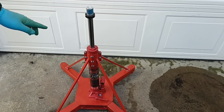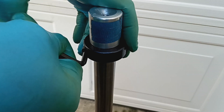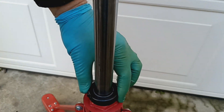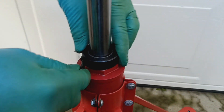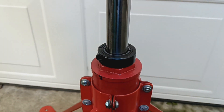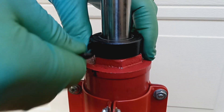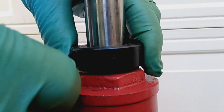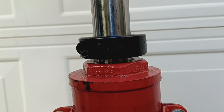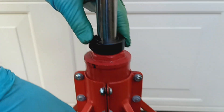There's a safety collar that I had installed — it's a commercial off-the-shelf collar with a 25 millimeter diameter. This collar was down against the top of the jack and tight on the shaft. The pump wasn't working and I could not raise it. Normally I wouldn't leave it against the top of the jack; I would leave it up a little bit. When I came back to the hangar, I found the collar was down against the top of the jack and the pump did not work.